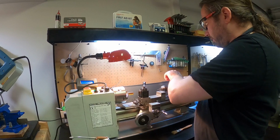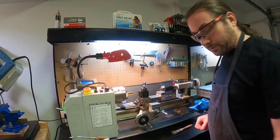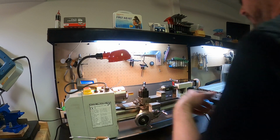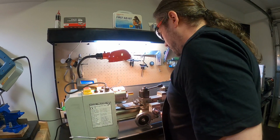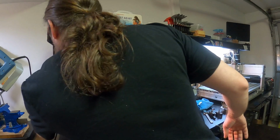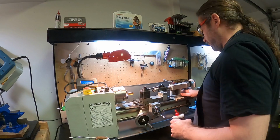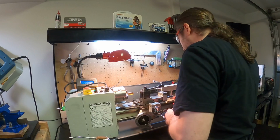With tapers too, you should never turn a taper. You want to just push it in. Turning it will ruin both tapers, the male and the reciprocal female. So don't do that. Get your compound out of the way. Sometimes it's nice to put a little oil, because when you're sliding this thing back and forth a lot, it's just handier for it to slide easier, of course.